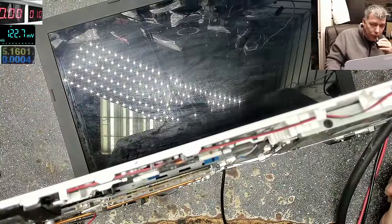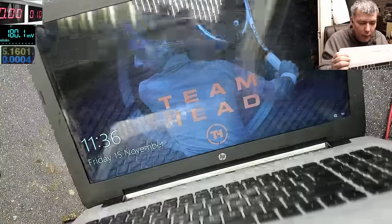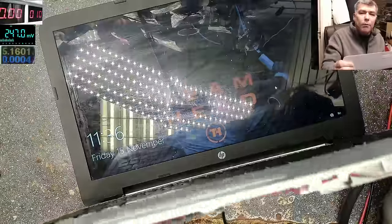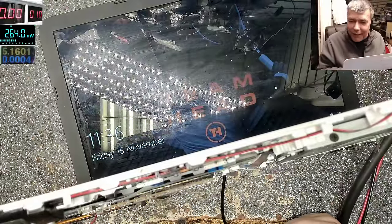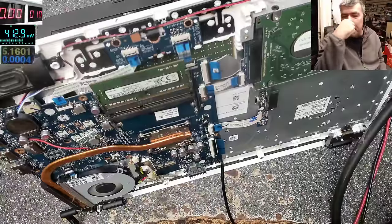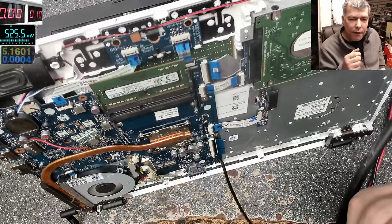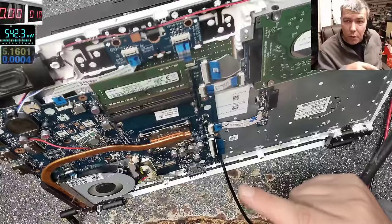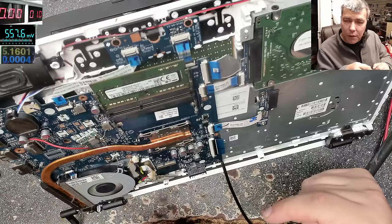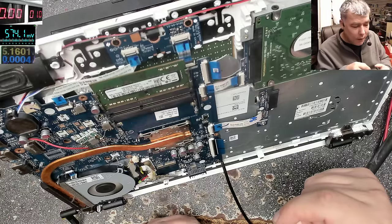Hopefully. Okay. Obviously the power supply can be fine tuned, yeah, if it has any issues. But the only issue I'm scared of is the voltage being too low and the laptop starting to freeze. That happens when the voltage is too low. But I know it's not low because if I raise the voltage, like 5 minutes ago, to 1.1 volts, the laptop will not start. That means I am on the top already. So I just lowered the voltage a little bit and the laptop started working.